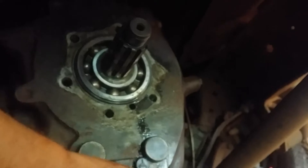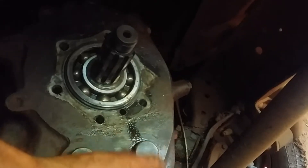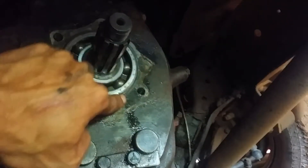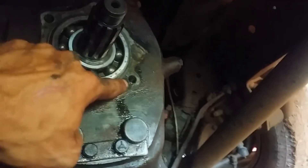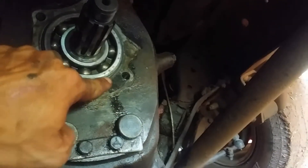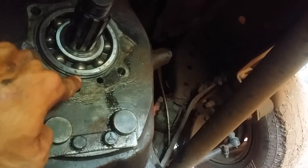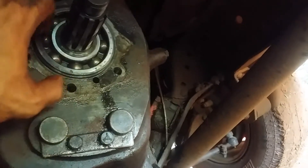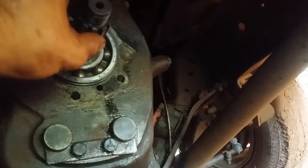It's the same silicone you use when you take the back cover off a differential — some don't have gaskets, some use silicone — so it should be fine on this cast iron case. When I take the wire cone to it, I have to be very careful not to damage this bearing. There's a snap ring — a really big snap ring — keeping this in place. If you're careful, you don't need to worry about the alignment of the shaft; it doesn't move at all.